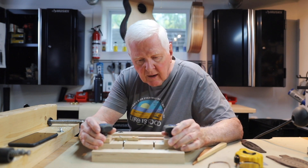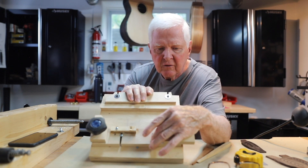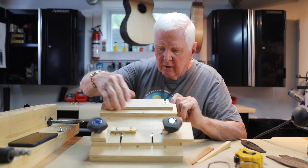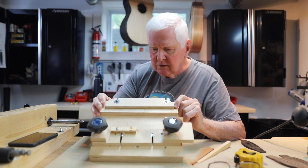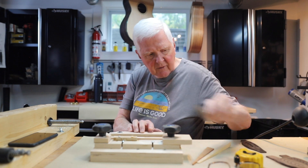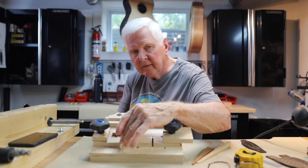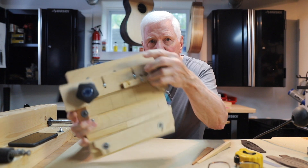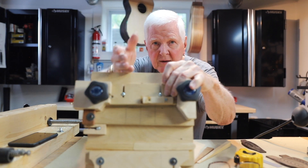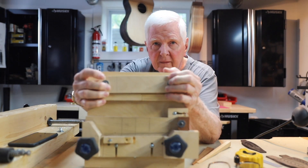The fun part comes on the top layer, the thinner layer. What you have here where these knobs are, this is about one and three quarters inch in thickness by 10 inches. And this is actually two inches — this is about one and three quarters. It's a little inboard of the 10 inches, this would be about seven inches. So what we do here is we slot both this side and this side. You can see those slots there. I just simply did these on the bandsaw — I just ran it in and took it out — and I did the same thing on the other side.